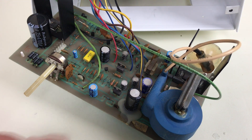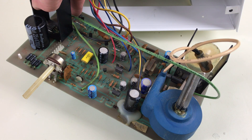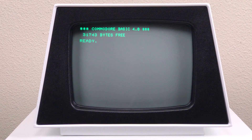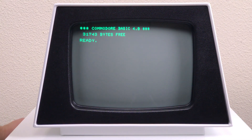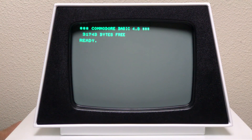Now just out of curiosity, I've gone ahead and put the 3.3 microfarad cap back in here, and left the resistor and Zener diode mod in place of R2, just to see how it behaves in that configuration. So currently we have C22 returned to its original value of 3.3 microfarads, and R2 has been replaced with the resistor and 8.2V Zener diode. With the brightness turned all the way down — a very small spot. A little delay and a quick fade out.